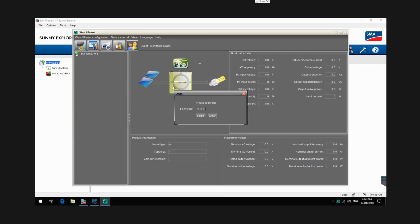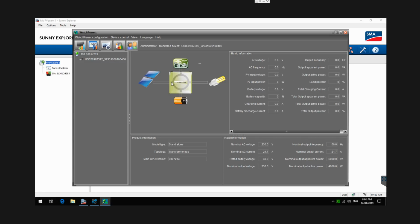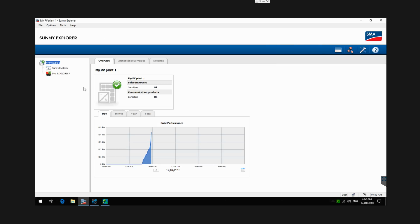That one is, administrator, enter. There you go. So the house is using, come on, propagate the second inverter. The house is only using 379 watts at the moment, and we're in battery mode. But we're charging the batteries at 7 amps, so that's not bad. We're covering load and actually getting energy in. Inverter loading. Bluetooth is so yesterday. So we're doing about 2,000 watts. So we're probably heating hot water with about 1,500 watts at the moment.